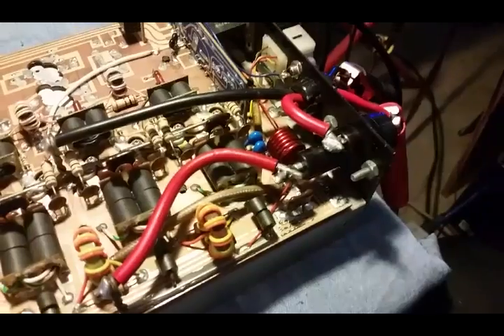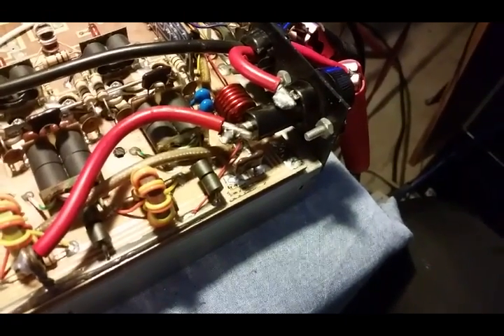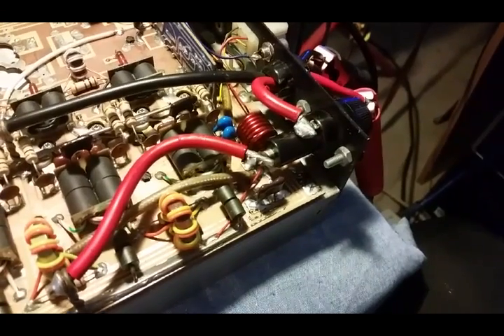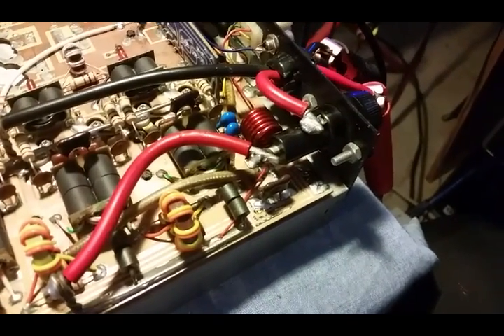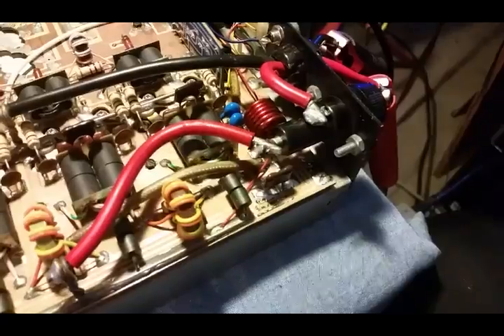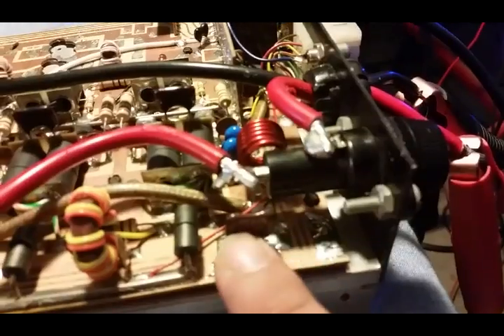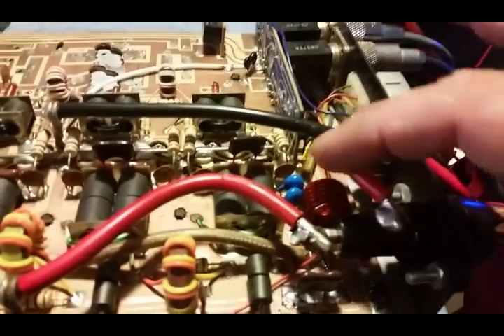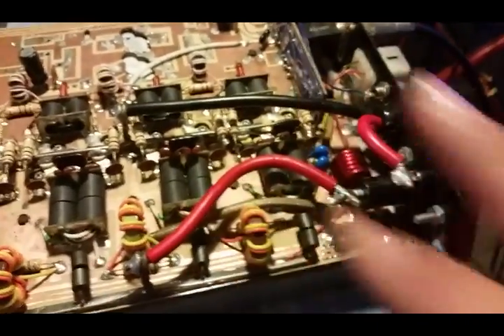Anyway, like I was saying, that is a cigarette by the way — nothing smoking. The trimmer that was left in from the factory — those trimmers are usually only rated at about 350 RF volts around there. I've found that a lot of them will just kind of get weak. I found one that had arced on me in the one I did for a buddy of mine, Mr. Real Deal — it had actually arced and shorted out. So I went ahead and put a bigger capacitor in there for you — DM-19. It pretty much had DM-15s in there. And that's in between this simple output filter here. Really neat. I do like the way they do that. These are great amps from Sideband — they really are.